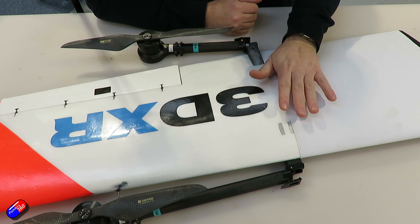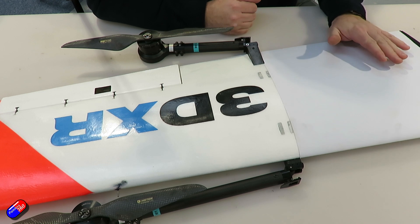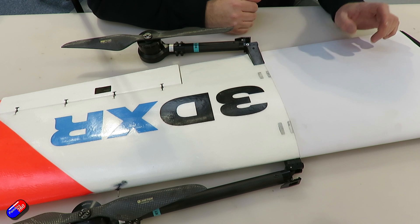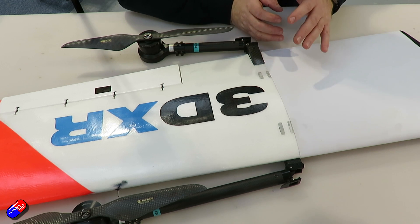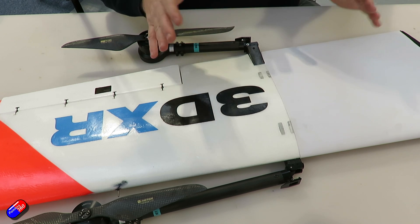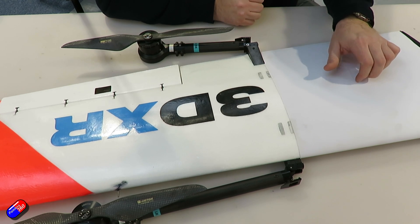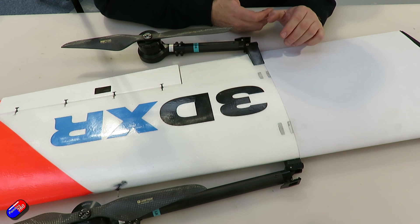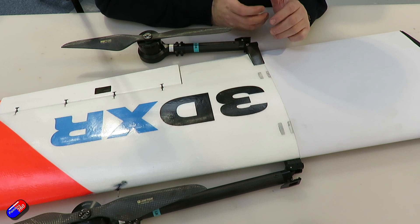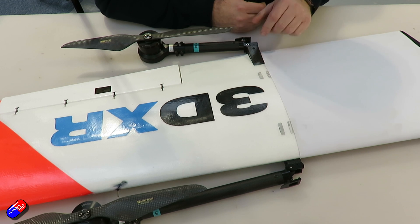It's really important not to forget what looks like a plain white sticker — this is actually a reinforcement. It comes in your Fighter VTOL kits and it's a very rigid sticker. The VTOL arms create a sort of H shape, and this stops torsional twist. The reinforcement is vitally important. A lot of people who bolt arms onto a standard fixed wing aircraft find them very weak, and this simple sticker provides a lot of extra rigidity. It's very obvious if somebody has forgotten it.